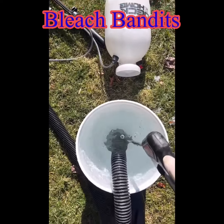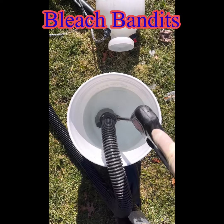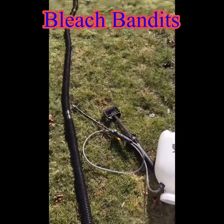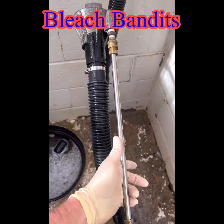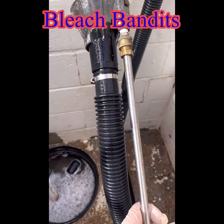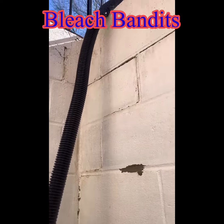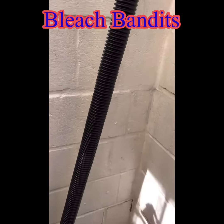This tool was a must-have for every pressure washing company — just watch how fast it pumps out the five-gallon bucket of water. Most people use double braided line, but for cost-effectiveness I use this sump pump line here, septic pump line. It works just as good but does not last as long and is not as strong, but preventive maintenance is required anyway with the hose clamps and all, so I don't mind changing it every once in a while.